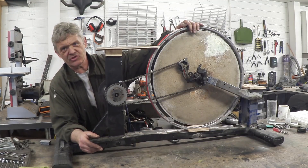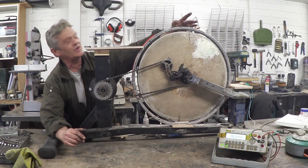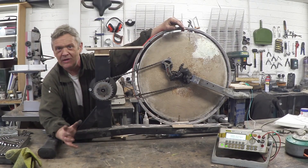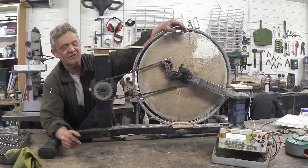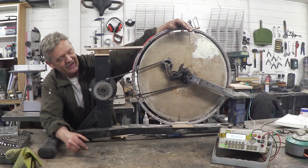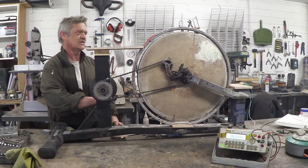We're going to put some magnets in there north-south, give it a spin and see what happens. I've only got two magnets on it — there's one here and one at the bottom there, pointing north-south. They are 20mm by 2mm thick neodymium magnets. I could put more magnets on it and I will do, but I want to play around with the arrangements. I've just got these two little ones to show the proof of concept. I'm going to crank it up in a minute and I've put the voltmeter right there with its Kapton tape so hopefully you'll be able to see that. It did read just over half a volt the last time, so let's see what we get.